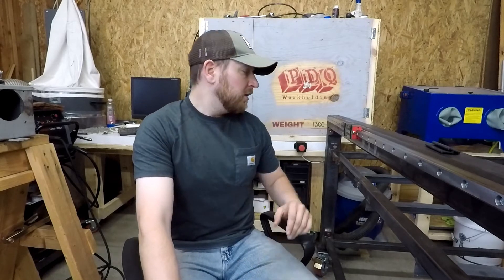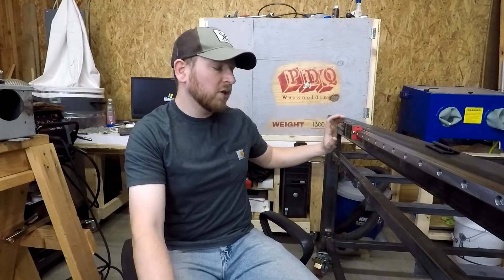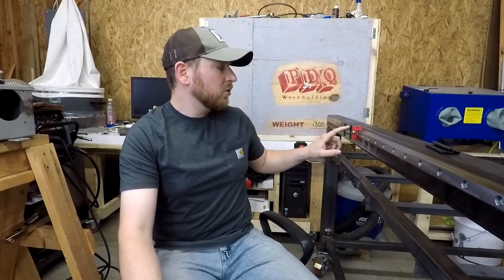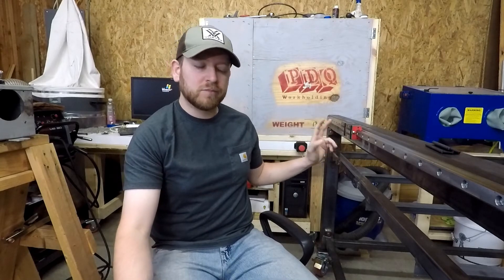The fabrication here is done other than the water table. I've got some scrap aluminum that I can make a block out of — it'll be really thick but it won't matter. I'm going to use the CNC to spot drill those holes, and then I'll drill them with the drill press. I don't have a Jacob's chuck for the mill, so there's no point in buying a collet for whatever size drill I'm going to need. I just spot drill them and don't have to worry about it at all.